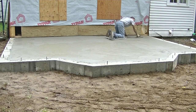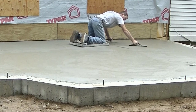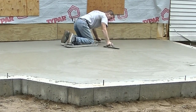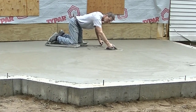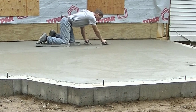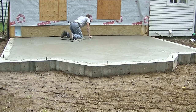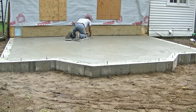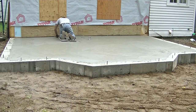This is a good way of showing you just how to get a pretty smooth finish by hand. Now this eventually is going to get some tile over it or some hardwood or something, so it doesn't need to be as smooth as glass, nor does it want to be for something like that. The builder basically just wants something flat and fairly smooth so when he goes to lay his flooring over it, it's going to lay nice and flat. You can see how I work my way from one end to the other, then turn and come back the other way. I can reach about a good six to seven foot area using both arms as I move myself backwards. With this being about 12-13 feet wide, I only need to go down one side then back down the other, and I pretty much have the whole thing covered.